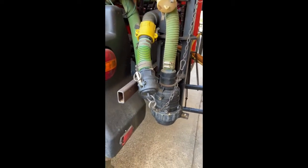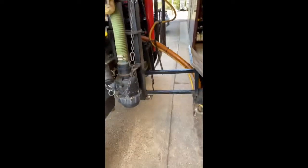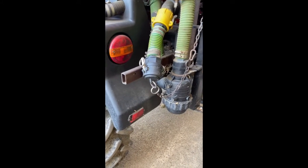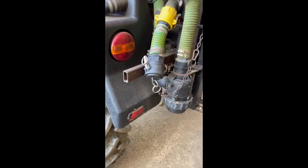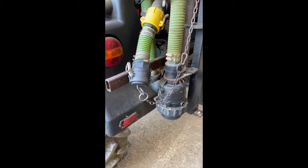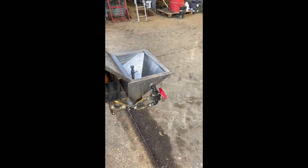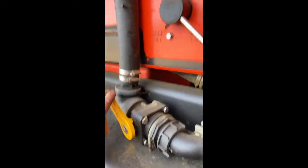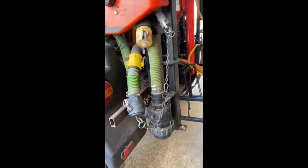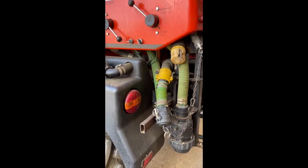There's an extension on the input because of the mud guards. There's a fast fill on here too — we fast fill with a diaphragm pump on the bulk tank at home and on the bowser, pushing the water so the pump isn't dragging it. When we push in with either the pump at home or the bowser, the pump is pulling clean water into the induction bowl, and when this valve is turned it goes to the quick fill as well. So with clean water in the hopper and the fast fill working simultaneously, we can actually fill this sprayer with chemical from the bowser in six minutes.